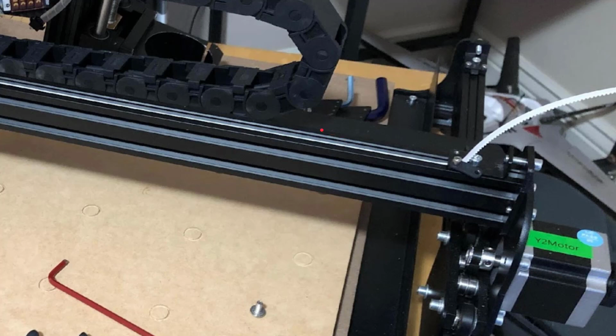I tested this in mine, and I ended up the 1/4 inch was about the right place to set these, and then I cranked it down. It ended up I cranked one side down almost all the way, and the other side not a whole lot. The whole belt was nice and tight at that point.